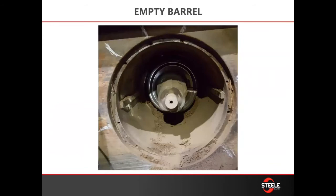With all the adapters removed, you can remove the number six auger and the number one rear liner, and then you can get the number five. If you're changing a full set of augers, it's time to pull your fast feeds after that.